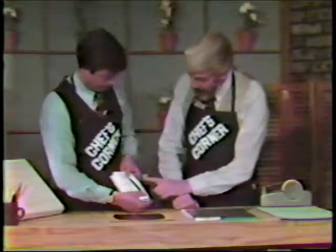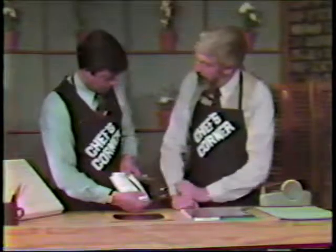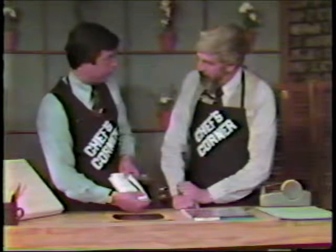And what do I do with this? Well, we would expose just that on a metal plate and then develop the image with desensitizer and lacquer, and you would be looking for a solid step 6 on here. Solid step 6, so a complete black.